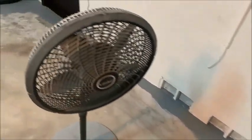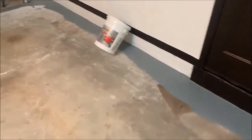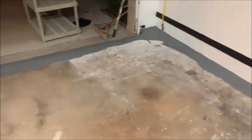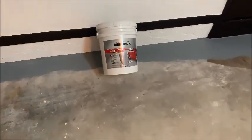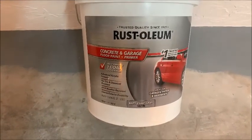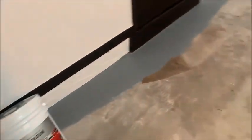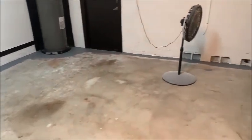We're back and I've cut in the floor all the way around. This is Rust-Oleum paint — it takes about 24 hours to cure good enough where you can walk on it. Tomorrow afternoon when this is all dry we'll be able to put stuff back. This Rust-Oleum is water-based, it's battleship gray, and it's a satin finish — just for floors. It's a good product, covers in one coat, you don't even need two coats. Let me roll this floor out and we'll be back.